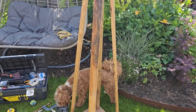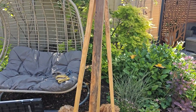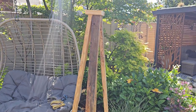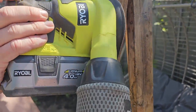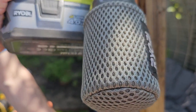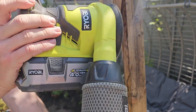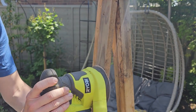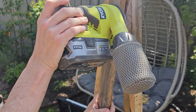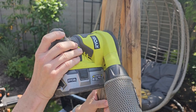This is the four pieces together, all attached onto the main top. We then used our sander to sand them down. Some of these pieces had been left out exposed to the weather, so they had silvered up like larch does, but I wanted to go for more of a golden look to bring out the actual color of the larch.